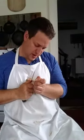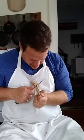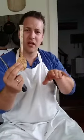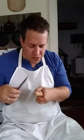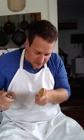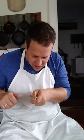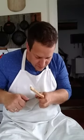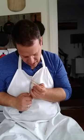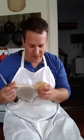All right, here's a really important point. If you're struggling down in the neck, say you got a little bit of tear out, it's usually a better move to come down from the handle like that, again just a little bit, and leave it attached, and try and get as low and tight into that shoulder as you can. This is partly why I find really tight but curved corners on those shoulders much easier than more broadly curved corners, because you can get down tight and then it's just a very short distance that you're trying to clean up. You can usually do that with a very simple twist. And if, like here, it didn't quite clean up, it's just a shorter distance that you're trying to resolve compared to a broader curve. So I've found that it's actually less fussy, even though I used to think that they were more fussy, but now I think they're less fussy.